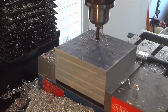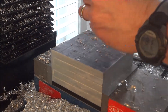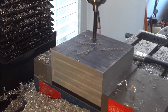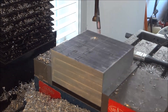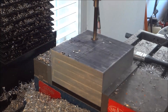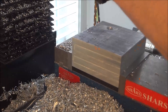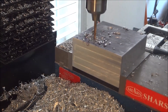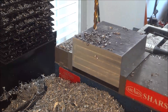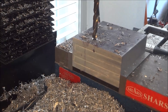As you can see here, I've kind of messed up. I couldn't remember which boring bar I used for the recess for the 6mm head — it was actually a 3/8-inch boring bar set that I used, not the half inch. So you can see that's why I'm changing out different boring bars. One of the holes is just not going to look right because of that, but it should be alright — it's just an aesthetic thing; it doesn't really change the function of the hole at all. I'm just going through the processes here, boring all these holes and getting the recess.